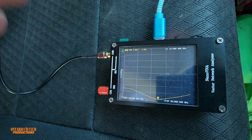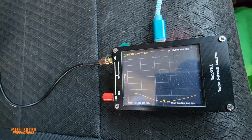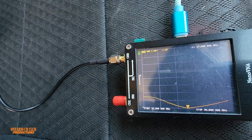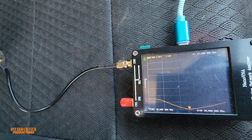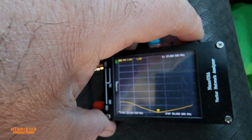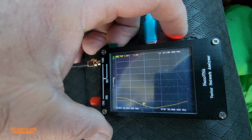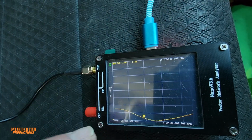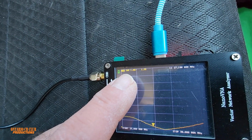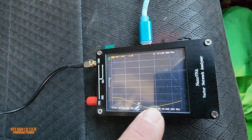mind you that again, this antenna, yes, it came tuned, but it may have been tuned by the previous person and been cut to fit. So this antenna works perfect at, what is it, 27,800. So even on the CB band, sorry, my hand is changing the focus. So even on the CB band, guys, look, from 27,100 we got 1.3. All right, and look, all this is acceptable.